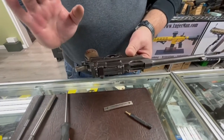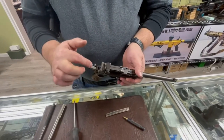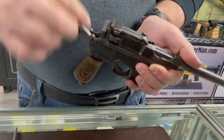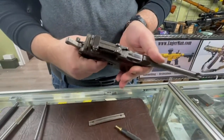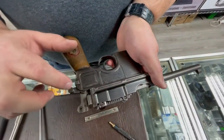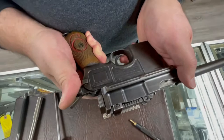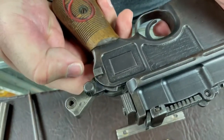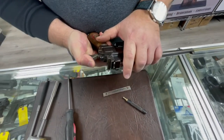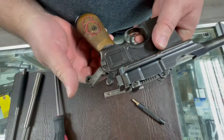The safety is not on, so you want to make sure you don't accidentally fire. If you have an old gun that hasn't been reviewed, sometimes if your hammer is not fully engaged, the hammer will follow and a shot will follow as well. You want to make sure your hammer is in good position and can always be engaged by the trigger. Learn to use the safety on this weapon. A lot of these designs were changed over time — some safeties will only engage with the hammer cocked. On many of these weapons, the way to engage the safety is you have to release some tension from the hammer, and then the safety moves up nice and easy.